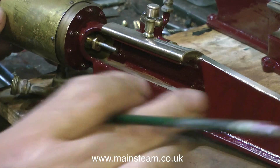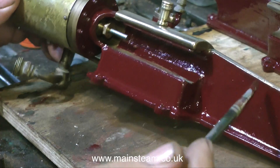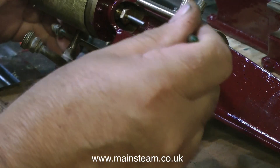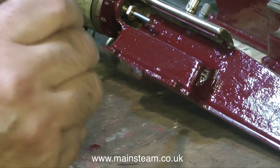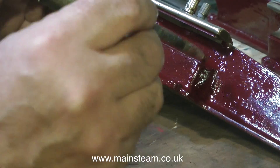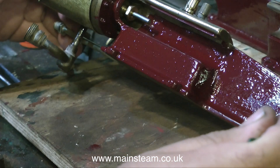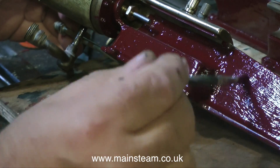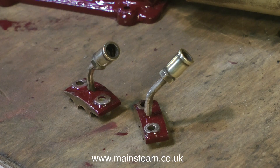Taking a good long look at this engine - as I've said many times it's very well made, apart from that one cylinder cover. But it's really a display engine rather than a working one, and none of the parts are robust. The crosshead for instance is just clamped to a soft piston rod with just one bolt. I feel it's really not worth all the hours that would have to be put into grinding off the bolts on the cladding, re-drilling, re-tapping, and having to do both sides to match, just to re-bodge and re-fit a couple of bolts in place of the studs.